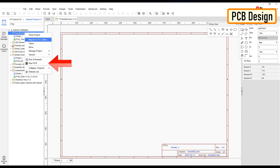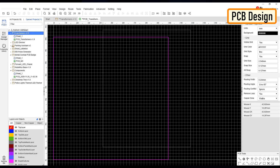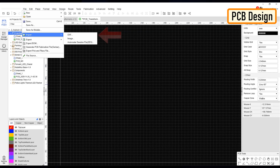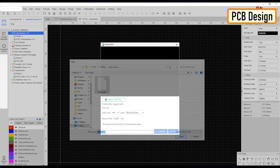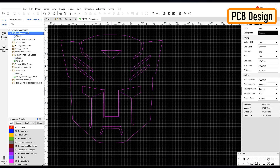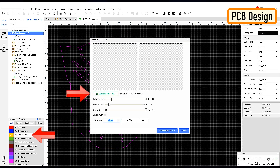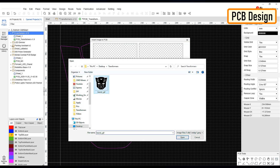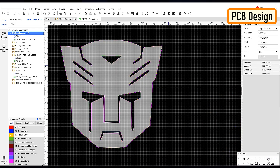Now let's go ahead and add the new PCB to our project and remove the default border outlines. Then import the DXF file via the File > Import DXF menu. Make sure you have the border outline selected under layers when you import the DXF file. Now let's import the image that will go on the top silk layer — select the top silk layer, import the image, and move it inside the board outlines. Before going ahead, let's have a look at how the board looks in 3D.